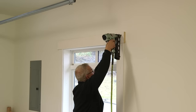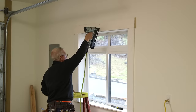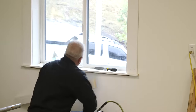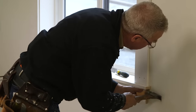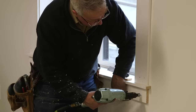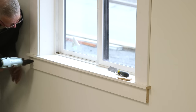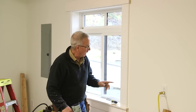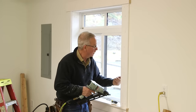Speaking of finish nailers, not only do they save time with the speed of driving the nail in, but they countersink the nails perfectly. A carpenter almost never has to stop, pull out his hammer, and dig out the right size nail set to drive down a protruding nail head for the painter. The danger is that it is so easy to put in too many nails, and the time saved by the carpenter is eaten up by the time wasted by the painter. Now's the time to hope I don't send a shiner out into the finish area as I'm nailing the case legs to the jam legs.